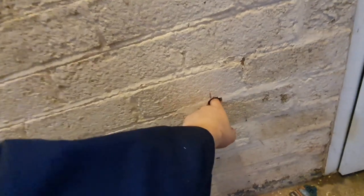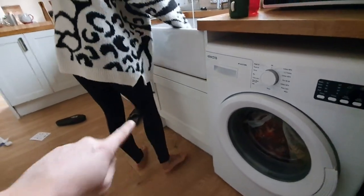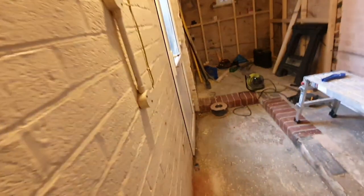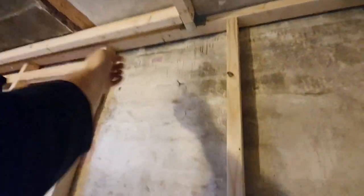What I've done is get myself a 20mm drill bit, SDS, on there — cheap one, that's 12 quid — drill straight through the wall to where I've got my original washer connection, which is there. I'll shove a pipe right through underneath. Under the sink there is all my connections, so I'll connect that up after. But what I'll do is run it in here first, run it up the wall, through these holes, straight across, down behind the stud to this one here.